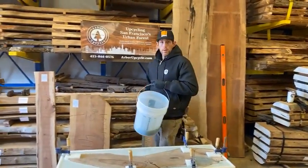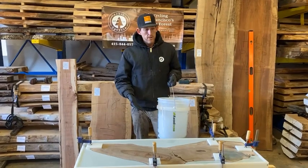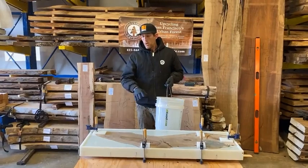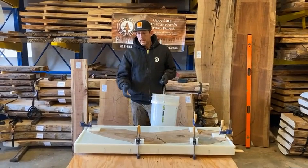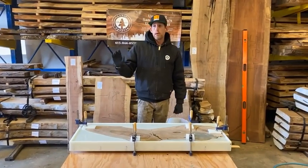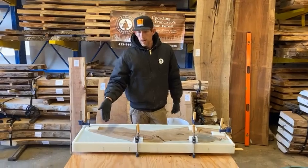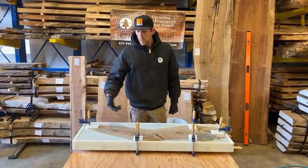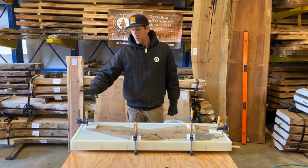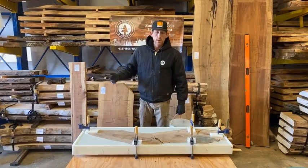It's not going to hurt, but this stuff has been designed specifically to use in this application. As long as you have, like I said, 80 grit along the live edge, where if you looked at it, you'd be like, oh, that looks terrible. You see all the swirl marks in it, but we're never going to see it, because we're pouring your color. So I think just a little bit of texture, you're more than good. But again, if you want to add dowels, it doesn't hurt for sure.